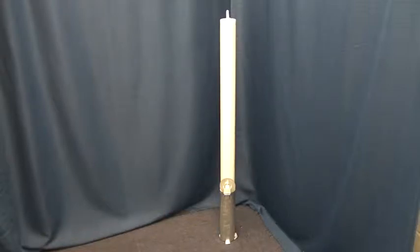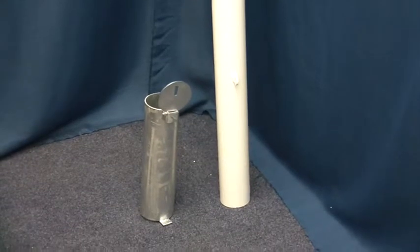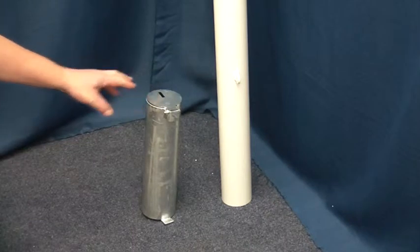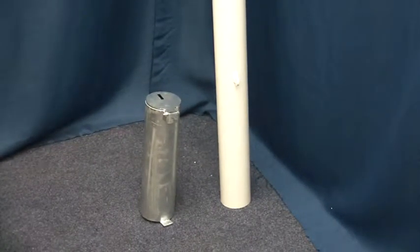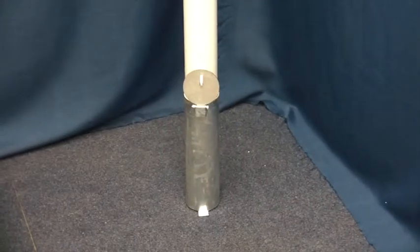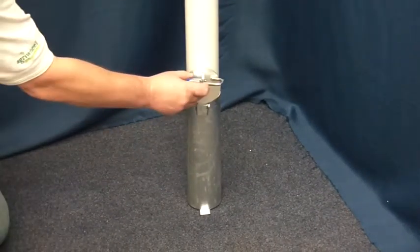Hi, this is a short video showing the 76mm diameter removable parking post with top mounted eyelet from Ultra Secure Direct. The post is supplied with a 290mm deep ground spigot with a hinged lid. The spigot is fitted into the ground using cement or post mix, flush or just above ground level. The post is locked into position inside the ground spigot with the padlock supplied.